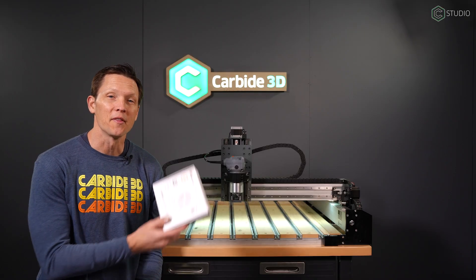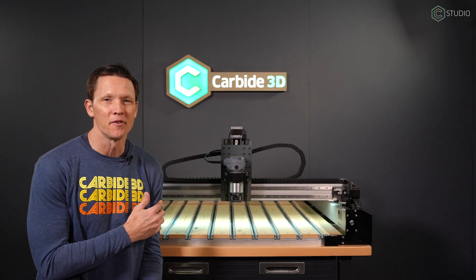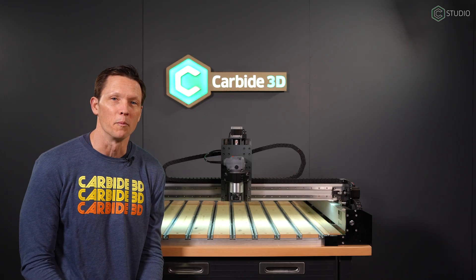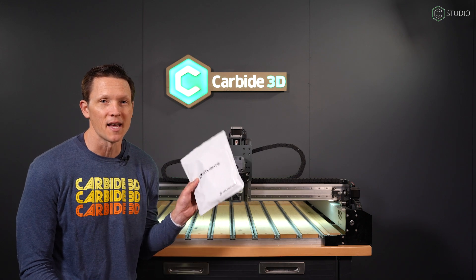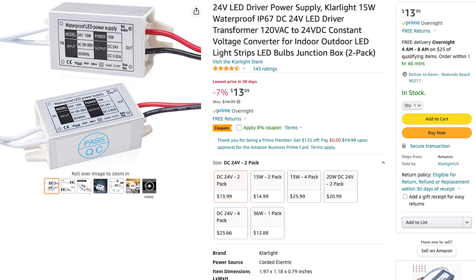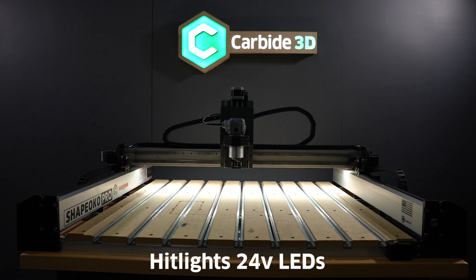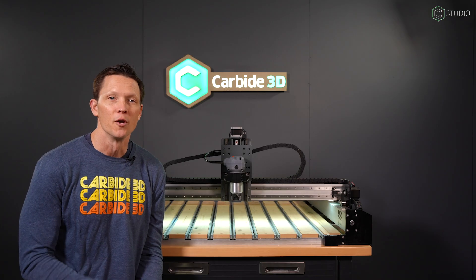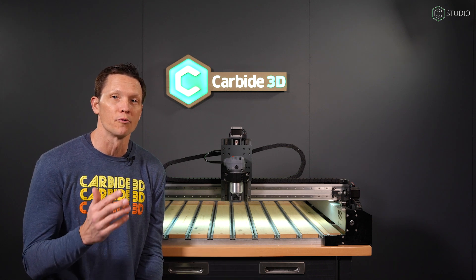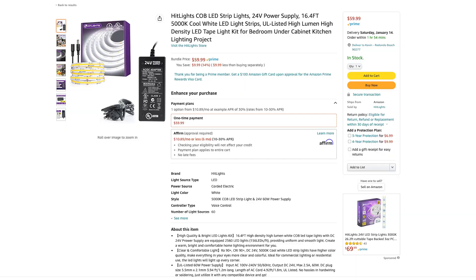So which kit would I choose? I think the Capetronix kit provides the best value and a reasonable quality of lights. You might have to lengthen the power cord, and you have the dimmer option — there's a lot to be done with very little money. If you want to move up to the Hit lights, they're high quality and you'll have a bunch left for another project. You'll need that external power supply and costs are definitely higher, but you will have more light under the gantry, and long-term the Hit lights will likely last longer. No matter what, I would go with waterproof lights, just to be sure you don't get interference from dust or other things over time — probably worth the extra few dollars.